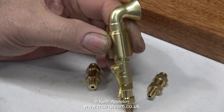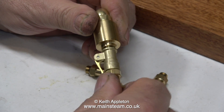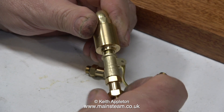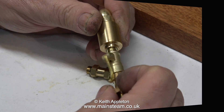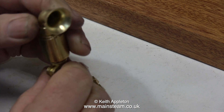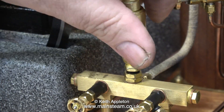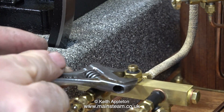The entire assembly, including the valve, is now much taller, and it's not as aesthetically pleasing as the original valve. I unscrewed the valve from the main body of the siren in order to fit an o-ring to seal it. The o-ring wasn't supplied with the kit, but I have some in the workshop. So it's out with the old and in with the new.